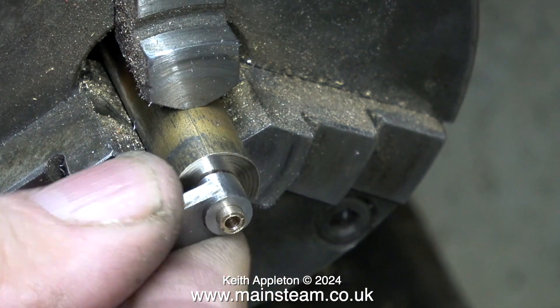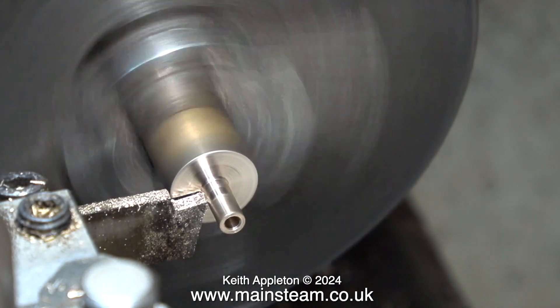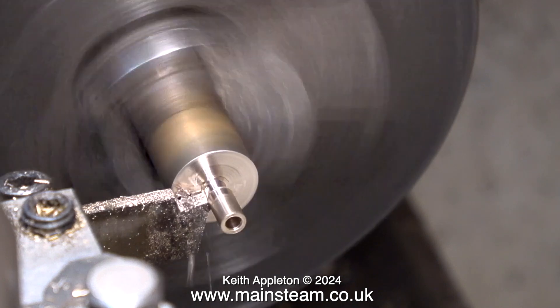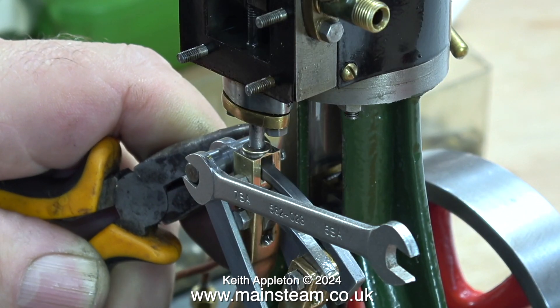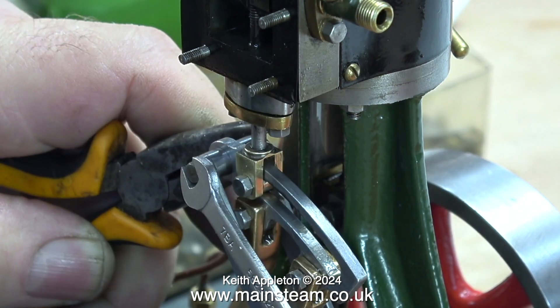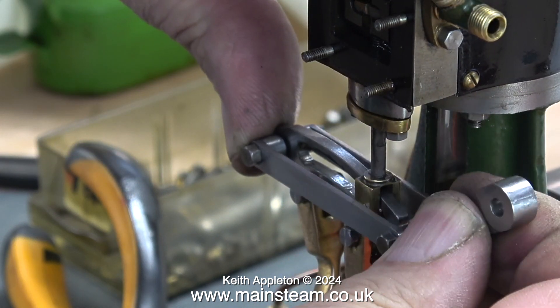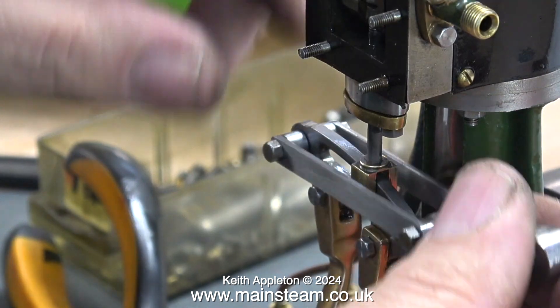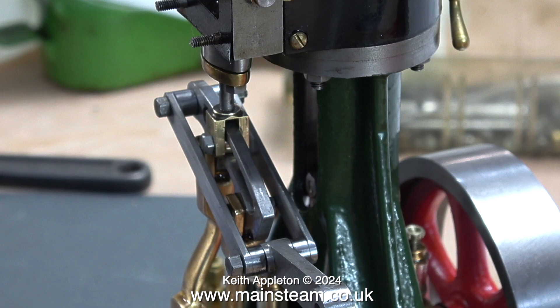To allow for parting off I'm taking off a bit more metal to make parting slightly easier. I'm trying the drop arm in position and then setting the parting tool to cut the bush to the correct length. A number 40 drill is clearance size for a 7BA bolt — it's a tight clearance size, but that's what's shown on the Stuart Models drawing, so who am I to argue. I'm sure it will all wear together once it starts to run. Until all of these parts are held together in the bracket and fitted with the reversing arm, it's quite difficult to move the expansion link back and forth, but there's nothing wrong with it — I've already tested that. I'll have a look and see whether a standard Stuart stud for holding a steam chest to a cylinder fits across this part.